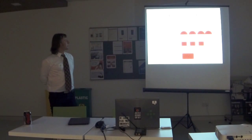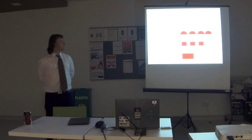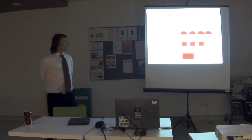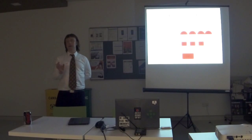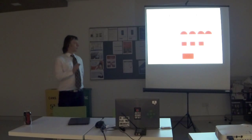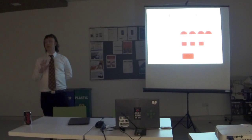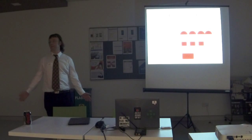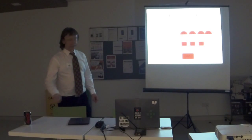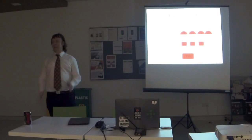As an introduction, the Wi-Fi spectrum is divided into many channels. Most of them are overlapping, so depending on your problems with a particular part of the spectrum and propagation, you can shift the channel slightly. But you also have four non-overlapping channels, so you can have four stations that do not conflict at all. And while the signal looks like it's concentrated in the middle, it takes the whole part of the spectrum.